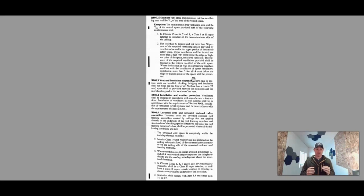It's important when installing a ridge vent to follow your manufacturer's installation instructions. Make sure you have soffit venting if it's required. If you're putting on metal panel, you won't put can vents up there or cut holes in your metal, so you'll put a ridge cap and probably a ridge vent — it's a good idea to add soffit venting, and if you've got room you can drill some holes and put some mesh vents. You really don't want moisture, mold, rotting, or deterioration — keep air moving through there. For asphalt shingles, you can put can vents across the ridge and add soffit venting down low; just make sure you have enough.